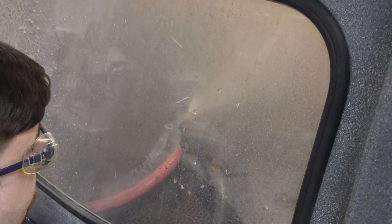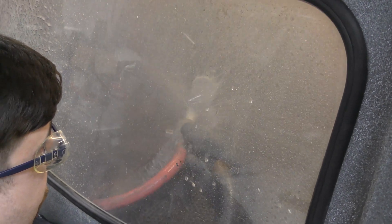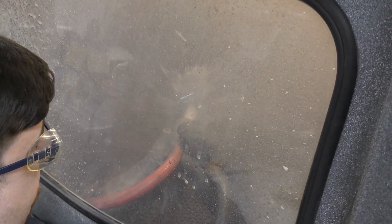The last type of media we frequently see used is silicon carbide. This is much like aluminum oxide — it has sharp edges, but it's a lot harder. This is the hardest abrasive we offer. It's great if you have powder coat applications; it's very quick at removing powder coat and re-prepping for powder coat, but does have the same characteristics in that it's sharp and cuts very quickly.